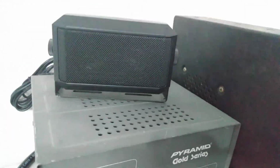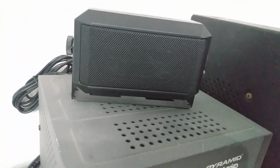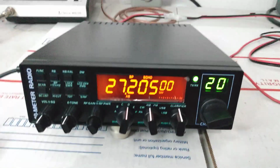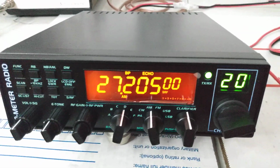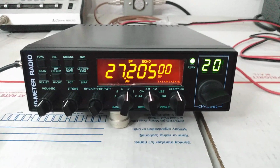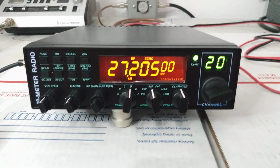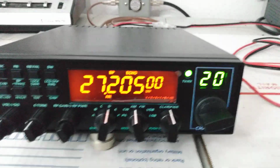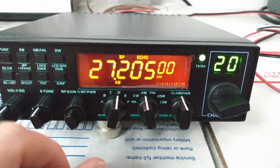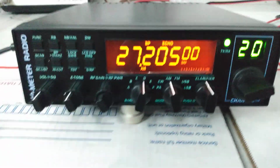Listening to it through another radio, these things sound phenomenal. Audio check, check, audio check, 1, 2. Probably not doing it justice there, but they're just a great sounding radio, one of my favorite radios out there based on how they sound. Now, the way they perform, there's not any big swing mods or anything that I know of for them, so they perform kind of like an HF rig. When you turn the RF power down, you're going to see the average power and the peak power come down a little bit. So we'll just test it wide open for now.